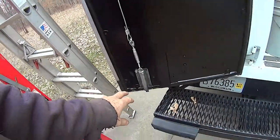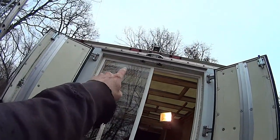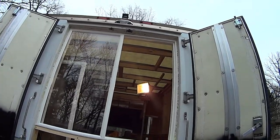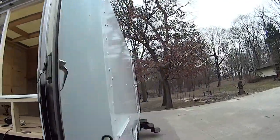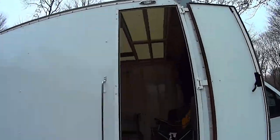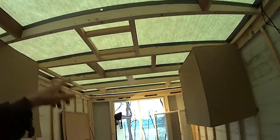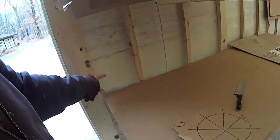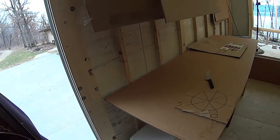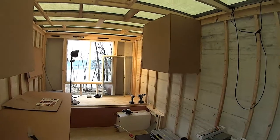Back here, I've got a light above and a backup camera mounted up there as well — I want to make sure the wires are in before things get buttoned up. The light is just a yard light, similar to one we put up over this door. I'm going to have those two yard lights plus a main house light, reusing one of the original lights from the back. I'll put a three-gang toggle switch panel here to control those two yard lights and the house light — utility lights with no dimmers. That's about it for right now.